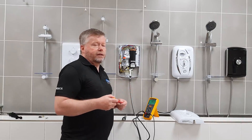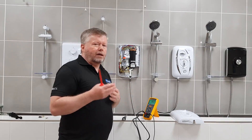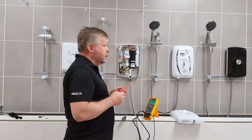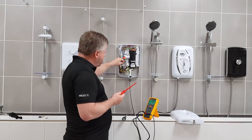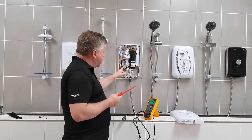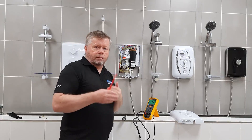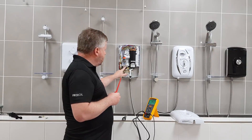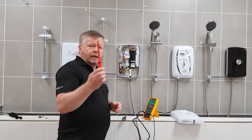To change the coil, you'll need a new solenoid that comes with the body — but we only need the coil, so the body can be discarded. With the power still off, remove both connectors from the coil. Take note of the orientation the coil is in, as it can sit in multiple orientations. In this shower it's pointing at about 10 o'clock on a clock face.